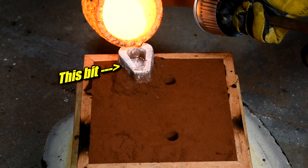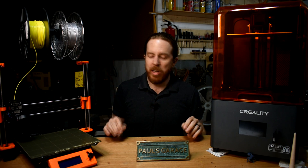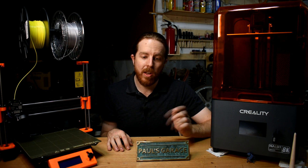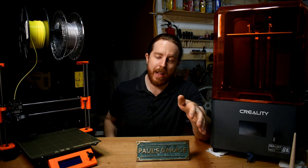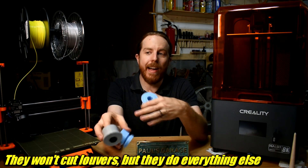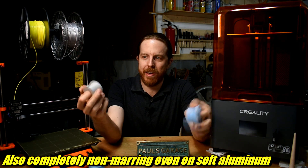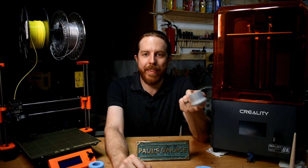This one is to make something called a pouring basin. More professional outfits use core boxes made out of machined steel, very precise, but I'm kind of a home hobbyist, so close-enough plastic works for me. I've also seen people use 3D printed molds for casting silicone, wax, or chocolate. As for sheet metal fabrication, you obviously can't get any of this near a welder because it'll melt, but I've 3D printed bead roller dies that I've used successfully on 18-gauge steel. You can print any radius or shape or bead you want. They're not going to work as well as steel ones, but they're a lot cheaper, and if one wears out, just print another.